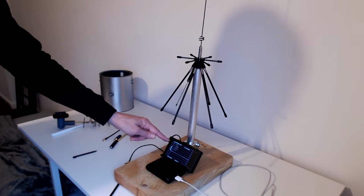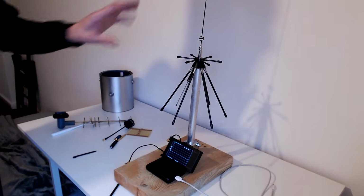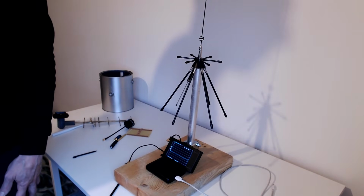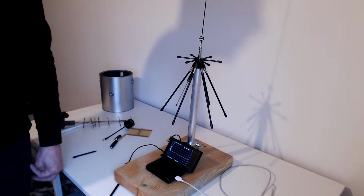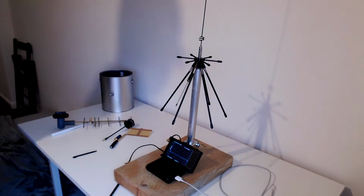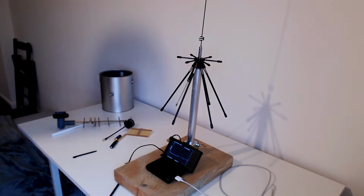This here is saying 10, 20, 30, 40, minus 40 dBs. So there's 40 dBs of insertion loss between this discone antenna and the tiny ground plane at the other end that I found just a few minutes ago. So 40 dBs, that's going to be my kind of reference maybe. It dips down to 50 depending where I stand, but the best signal I can get is -40.